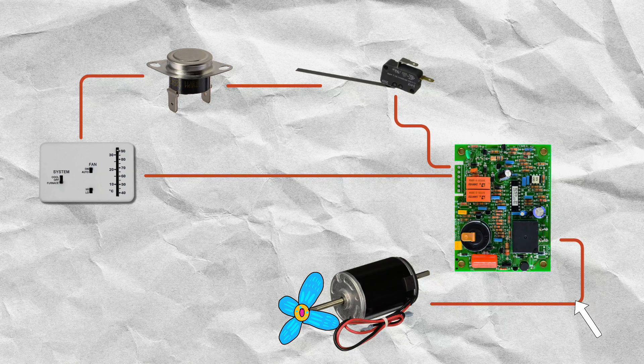The circuit board sends a signal out to the fan and the fan turns on. Your fan is going to run for 15 to 30 seconds to purge the burn chamber of any propane or unknown gases that may have crept their way in there. This is again for safety reasons, so that way before we start adding propane and fire, we get anything extra out of the burn chamber. This is also why your furnace is going to blow cold air first before it starts blowing warm air, and this is different from how furnaces work in a house and why it may seem like the furnace in your RV is acting up when it's really doing exactly what it's supposed to do.